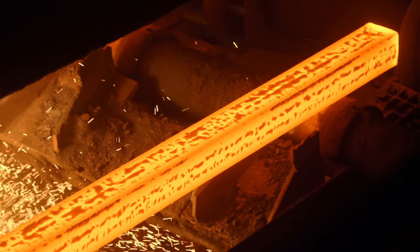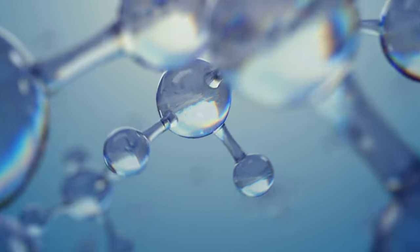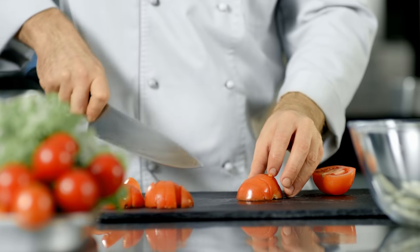The other advantage of stainless steel is that the carbon in the formulation - remember it's still around 0.8 percent carbon with your 13 to 15 percent chrome - that chromium and carbon react to form chromium carbides. These are microscopic particles which end up on your cutting edge; they're hard and they stop it going blunt. Chrome carbides are several orders of magnitude harder than iron carbides, so if you've got an equally sharp knife - whether 0.8 percent carbon steel or 0.8 percent carbon chrome steel - your chrome steel edge is going to last much longer.